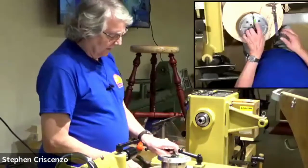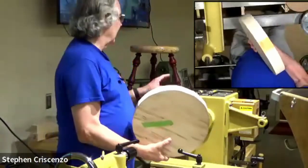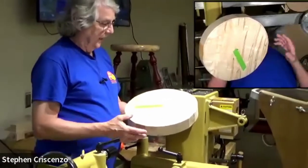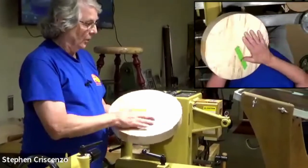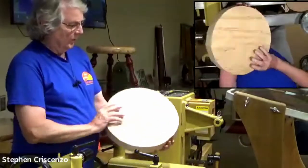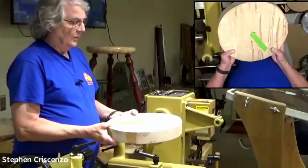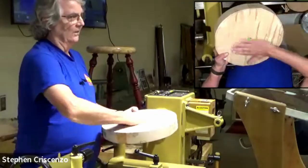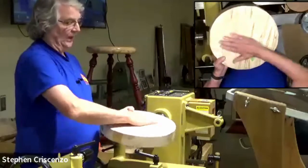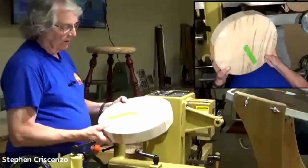The first thing I have to do is get my blank. I like to use a highly figured piece of wood, and I like to have a contrasting leg — so if I'm using maple I'll have walnut, or in this case padauk legs, or I'll dye the legs. Cherry works nice with ambrosia maple. I try to figure out which side has the most figure — that's going to end up being the seat. I run the back side through my planer to get a nice even face. If it's highly figured maple I might run it through my drum sander, but I get the surface flat and sanded and polished, and then I don't touch it again until after I drill the holes and sand out all the guidelines.